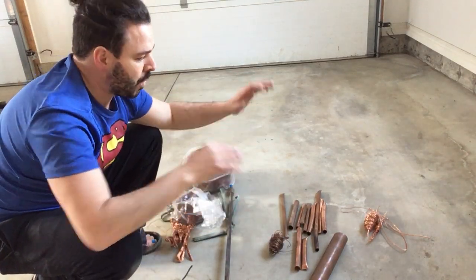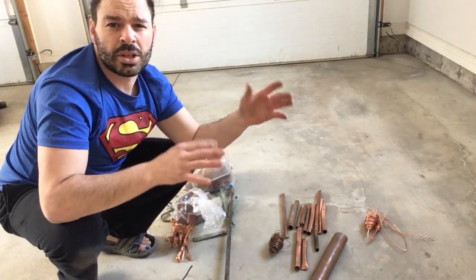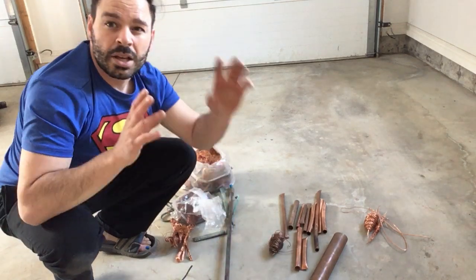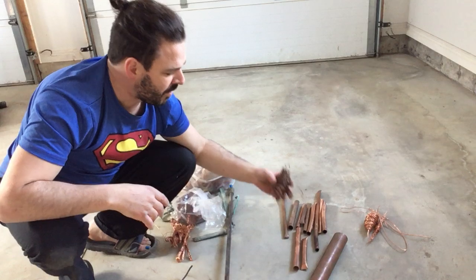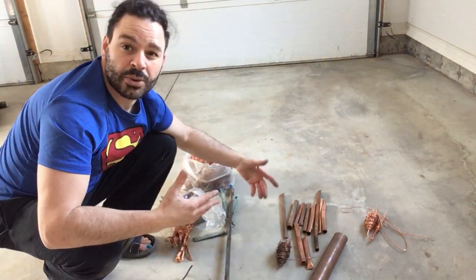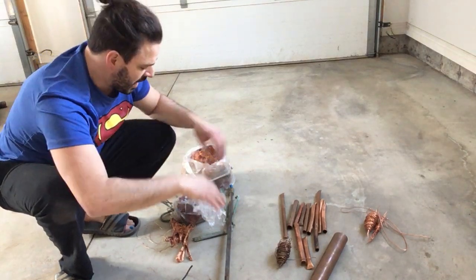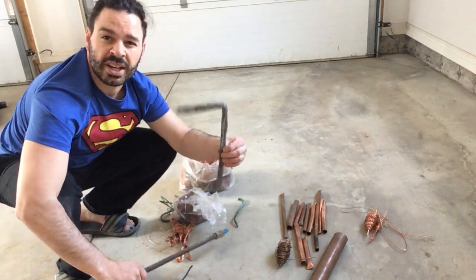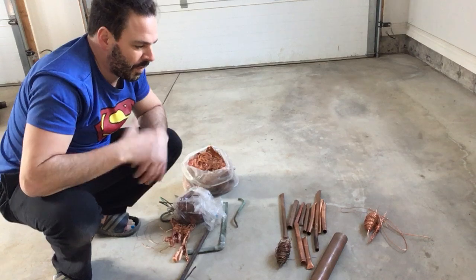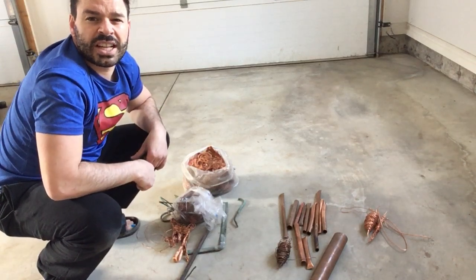There is a fourth category — sheet copper — but these are your three main ones. Quick recap: bare bright is copper wire that is free of all corrosion, has the shiny penny look, and is bigger than sixteen gauge — the thickness of a pencil lead. It does not include copper tubing. Number one copper is copper tubing and wire that is free of most tarnish, thicker than sixteen gauge, and free of any soldering. Number two copper is anything less than sixteen gauge individual strands, has brass or soldering on it, is heavily corroded, is motor wire, or has oil or coating on it. Hopefully that helped — please comment, like, share, subscribe, and I'll catch you on the next video. Tin Man out.